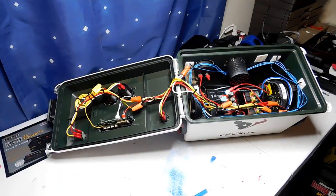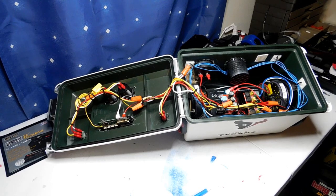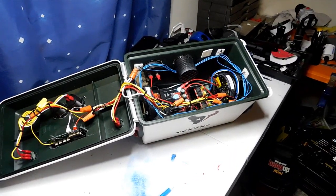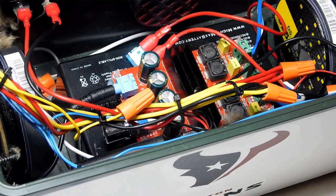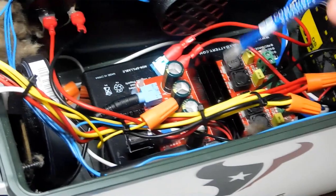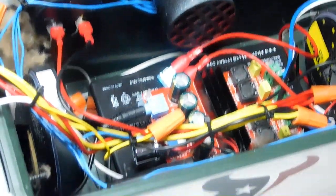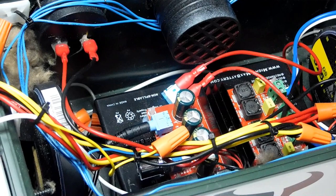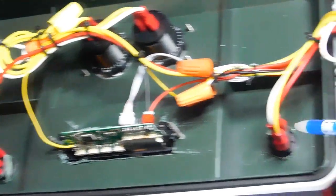Okay, we're back and now we're going to look at the inside of the Texans box. It's wired up very similar to the other one but has a little bit more stuff in it — Bluetooth with FM radio. With this one I've got a much bigger amplifier, about twice the size of the other one, and the amplifier is actually sitting on top of the battery — only place I had room. I did put a port tube on this one to try something a little different. This one has larger five and a quarter inch speakers mounted in the sides. On the switches, you can see the red wire coming in here bringing power from the battery.